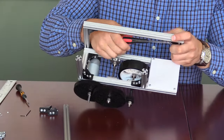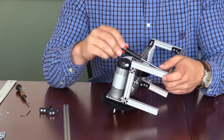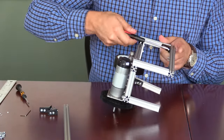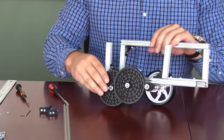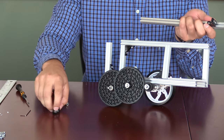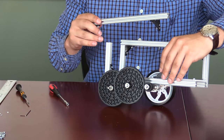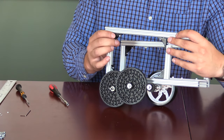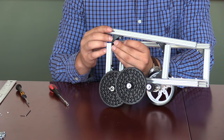However, if you've done this before adding the screws, there is no way to slide regular screws onto the top parts of those two pillars. If you do need to do this, you can do so with the T-slotted screws mentioned before. Once this side is completed, we can now attach the top part for the other side. On this one, I actually missed an additional screw — while we will have two screws on each of the upright pillars, we will also need to install one screw between the two corner brackets. If you forget to add the screw here, it won't be a major problem — we can fix this later, but it will take more time and effort.